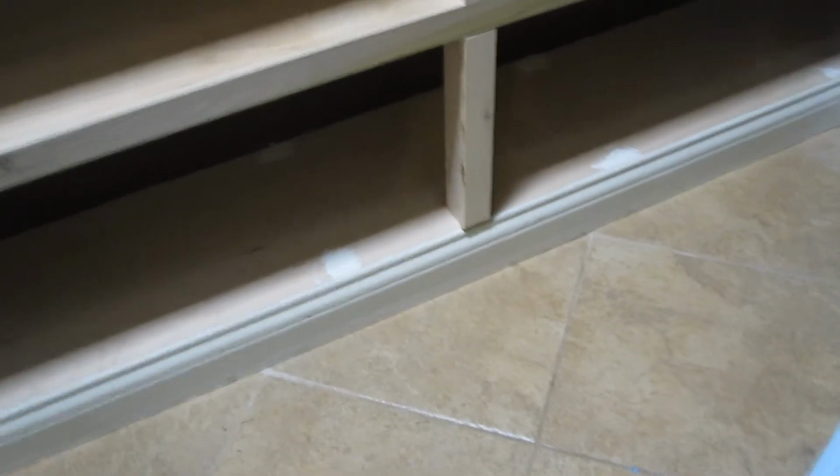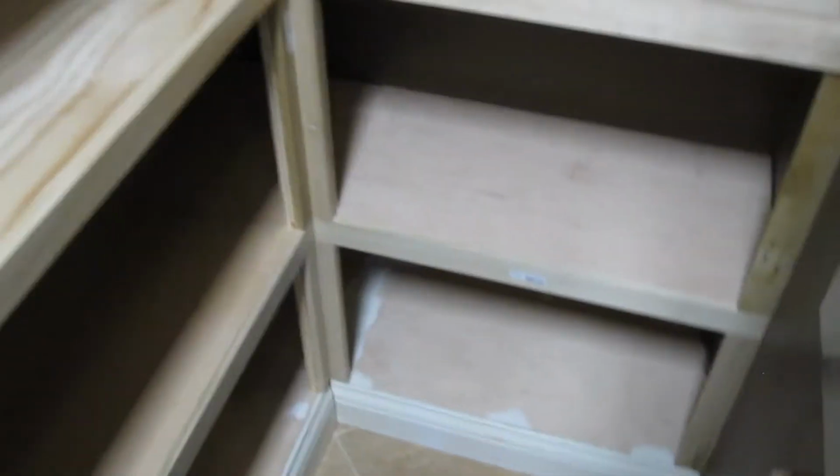But I went ahead and put the bottom trim down. I reused it, and got some spots to fill, but everything's back. And of course I'll have the quarter round to go on top of that to cover the tile. So now it'll be a bunch of fill, bunch of sand, and then paint, stain, and be done.